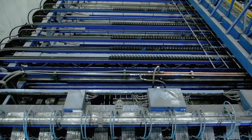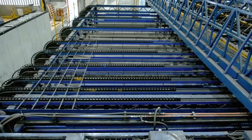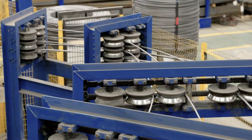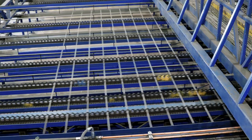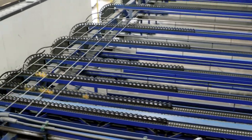The machine is highly flexible, running five different bar diameters for the main longitudinal wires up to a maximum diameter of 16mm, which are cut to length before being loaded onto the feed table, positioned at the correct bar centres and moved cyclically to the lower feed table and into the welding head where the cross wires are introduced.